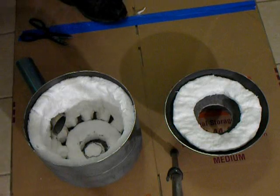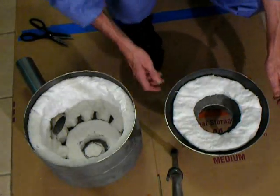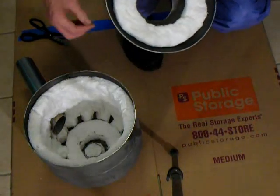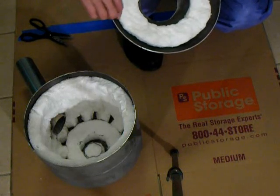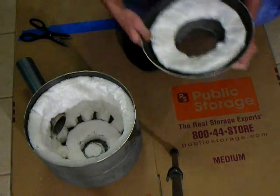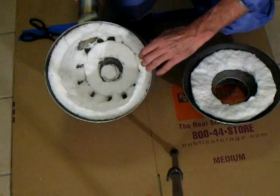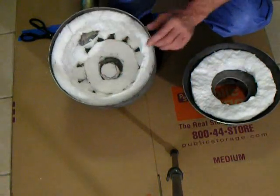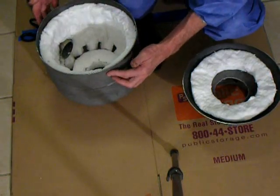This is what we want the insul-wool blanket that we're putting inside this to look like. We're going to add some stay wires to this — basically 1/8-inch gas welding rods to help hold the fire clay in place. We'll add a few along the top, and also on the main part of the furnace we're going to add stay wires along here and a few in the bottom. We'll do that by drilling a hole through it and doing the weld on the outside of the metal.